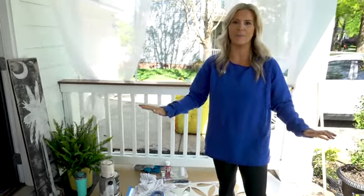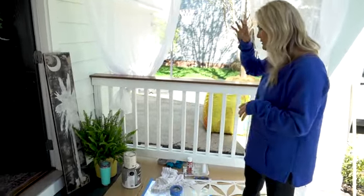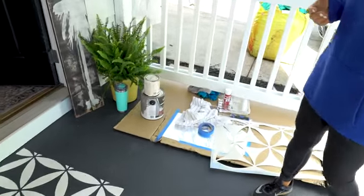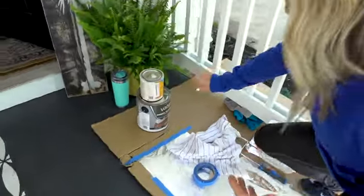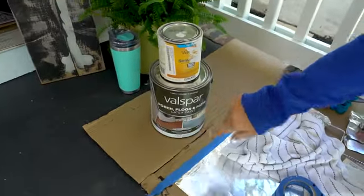There's going to be different things you're doing, but you do want to make sure you're cleaning the heck out of it. So definitely buy yourself a concrete cleaner, maybe an etcher, power wash it, get it down to the bare minimum that you can to make sure it's totally clean. And then you're going to throw a primer on top. So we used a really great primer made for concrete specifically, and it was a Valspar product. This is actually the color as well. So you'll see one in there that actually has the primer on it.